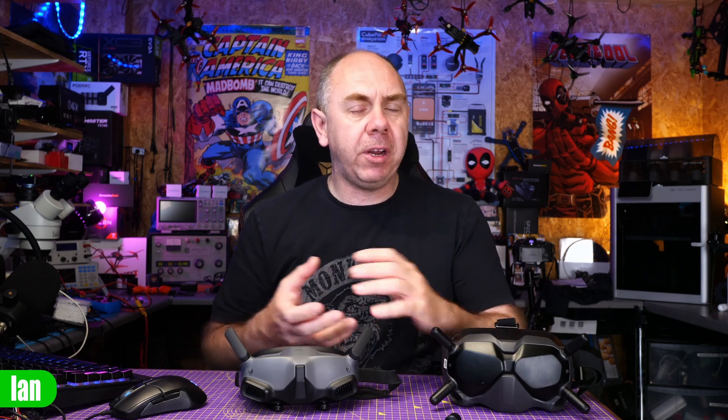Every now and again I see someone post and ask about problems with their DJI O3 or the original DJI FPV system where their MSP DisplayPort OSD is working but they can't get it to arm or auto record. The hint to this will be that their voltage showing at the bottom in the goggles is normally at zero. This is caused by a wiring issue on the flight controller, and what I'm going to do in this video is walk you through what it actually is and then tell you how to resolve it.